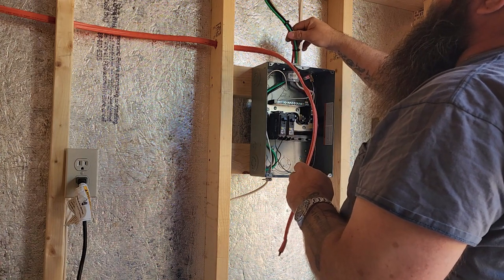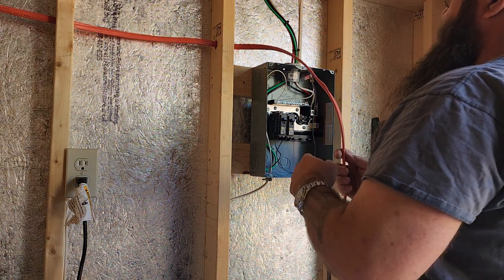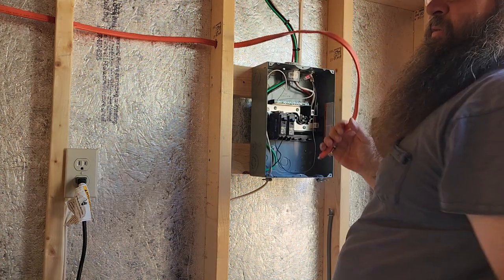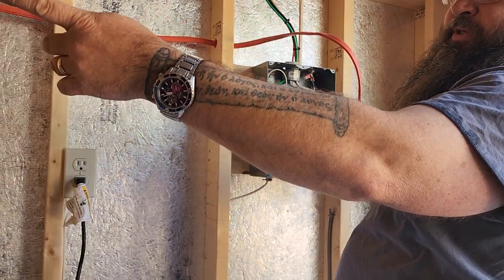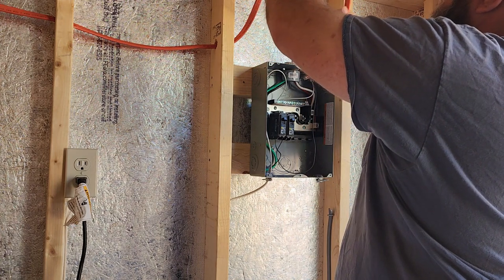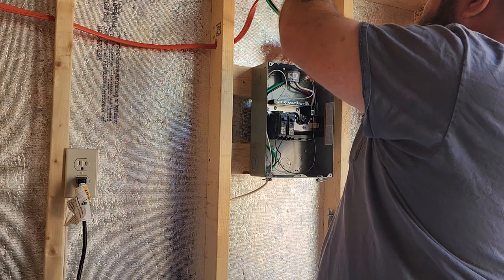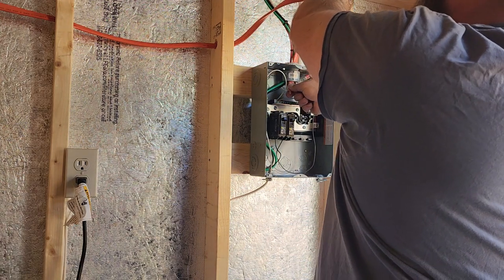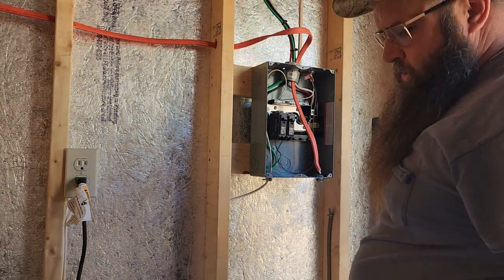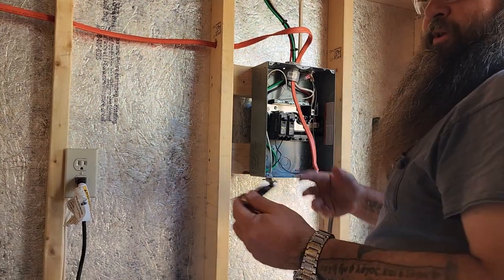Basically, this is 6 gauge cable. So I do have 50 amp service in here. And this is a 30 amp breaker that I'm adding. I've got a couple 15s there already. Even though I'm building this to what this is supposed to be, I've only got one 1200 watt ASIC that I will be hooking up to this. So I'm not going to be anywhere near the current rating that even this 30 amp can carry. If I did start adding more ASICs over time, to where I was getting close to what this cable is rated for, then I may have to reevaluate what I have coming into the shed here, along with anything else that I have.